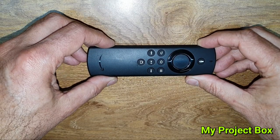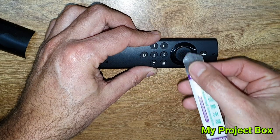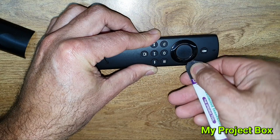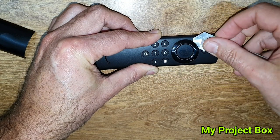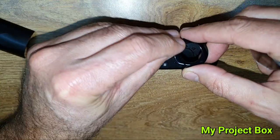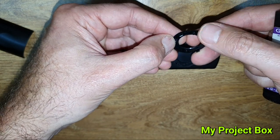In order to open your Fire TV Stick remote, you need to take the battery compartment off. The ring needs to come off because there are two screws underneath it. You can use one of these opening tools, or if you don't have one, a blunt kitchen knife works. Slide it underneath — there's a clip in the corner that you can carefully unclip and then work your way around. Beware of the ring's orientation when you remove it, as the cross pins are not all the same size. Be careful not to break the clips.